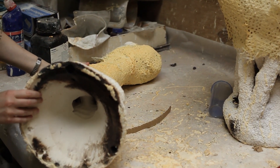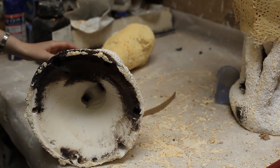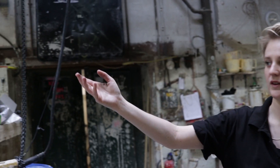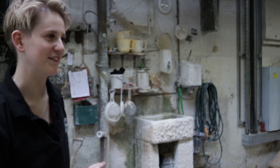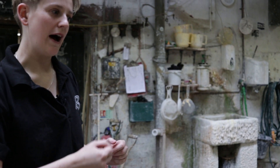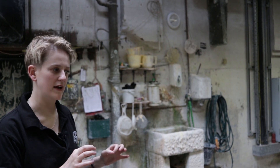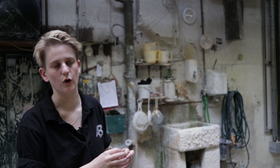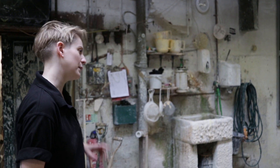Any big pieces get hoisted from that end of the workshop all the way down to here, and this is where we do knocking out. We use a hammer and a chisel, and as we hit onto the bronze it knocks off the ceramic shell. Any finer bits we get a tiny little chisel in, or we leave it so that we sandblast it instead. Some areas are quite delicate, so you don't want to be too harsh with it. Then we carry it into the metal workshop.